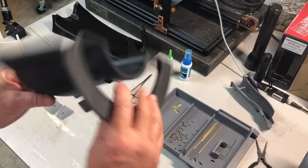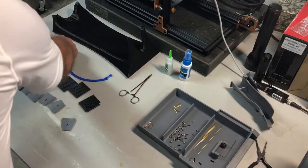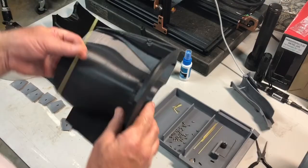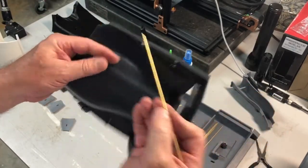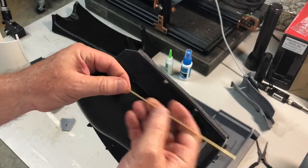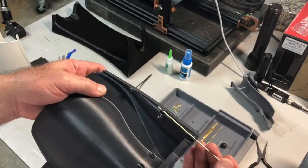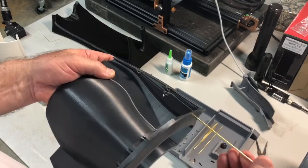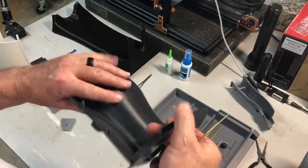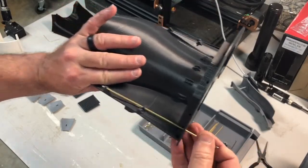The first thing you want to do is get your cowls, blocker doors, and drag links and size all the holes in them. What works best is taking a piece of brass rod like the one used for the guide rods, sharpen the end a little bit, then use a file to put a series of cuts on the side — this forms a reamer. Just run it through there twisting, and it sizes those holes. The holes on the stationary cowl don't need much clearance, but you do need to be able to get the rods in and out without too much resistance. There are two on the bottom and two on the top.